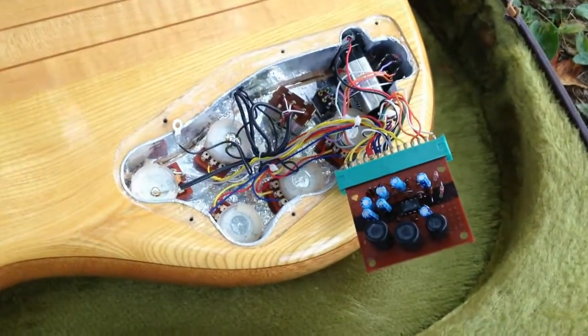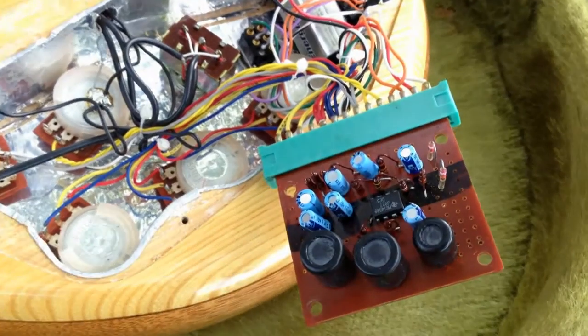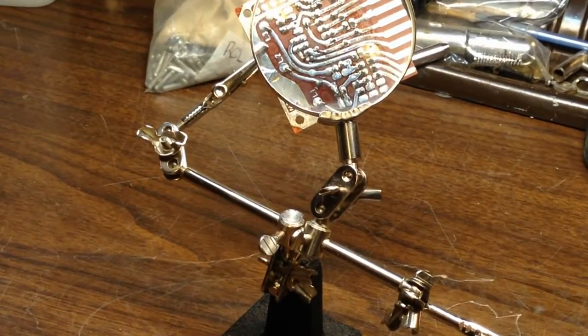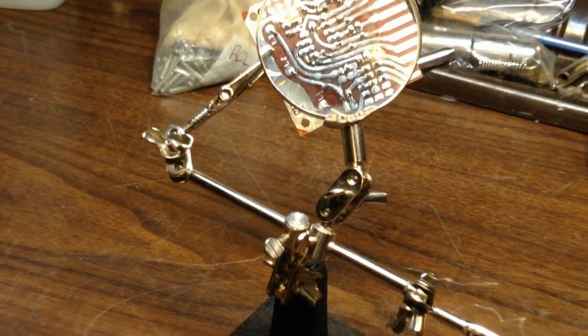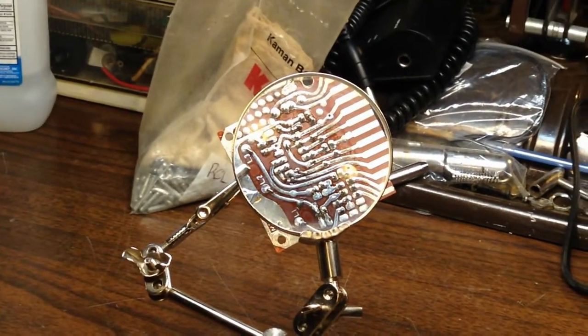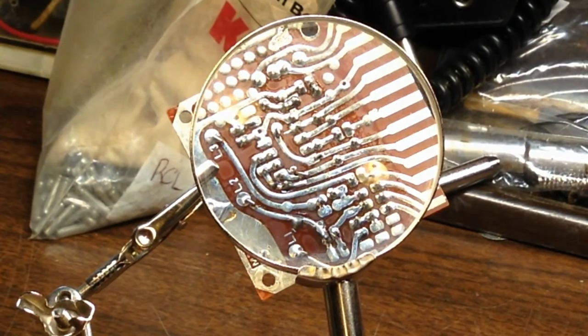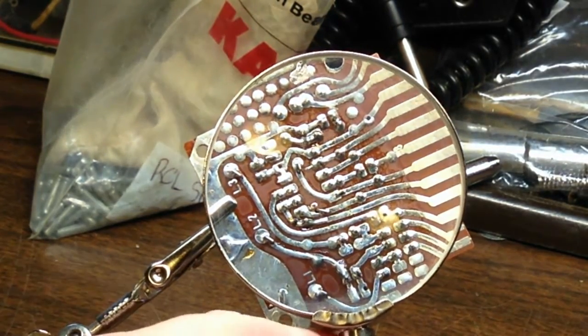Let's pull that little integrated circuit out of there. Anytime I'm working with little boards like this, especially with integrated circuits and trying to get them off boards - because there's so many legs - you have to use some solder braid or solder suckers to get these off. Sometimes it's kind of hard to see which connections you're soldering on. For this purpose we're going to use one of these little helping hand mechanisms. You can get these at Radio Shack, online, or Harbor Freight pretty cheap - I think that's where this one came from.